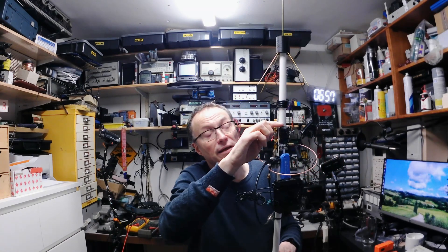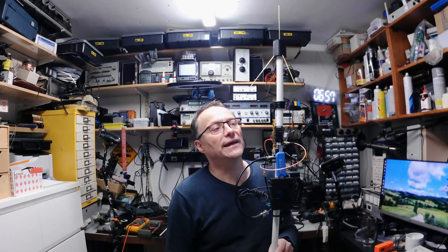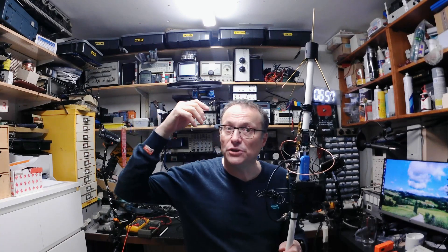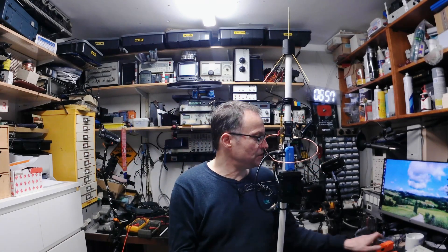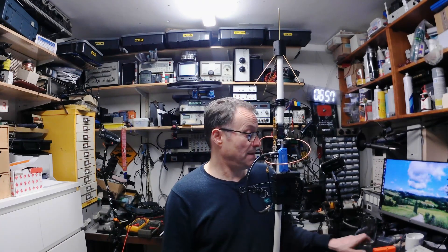This unit around here — same board again, it's another PAX counter — this is running an APRS iGate. So this is APRS over LoRa. APRS is Automatic Packet Reporting System. It's primarily a ham radio system used for transmitting weather information from ground stations, and also tracking information from GPS-enabled devices such as the T-Beam board. I've also got an APRS tracking transmitter in my car based on one of these and a power amplifier, with quite good range out of that.